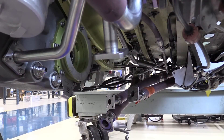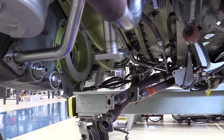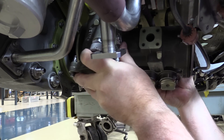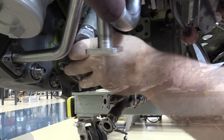I've got Brian down underneath the engine here and I'm on the video camera. Brian is pointing out the alignment pin on the accessory gearbox pad for the lubrication unit, and then we're going to go ahead and line up the lubrication unit onto the drive pad. We're going to center that up, seat the lubrication unit, and then install the v-clamp.